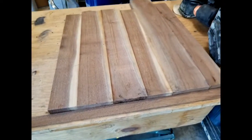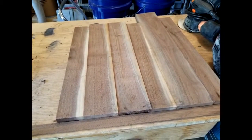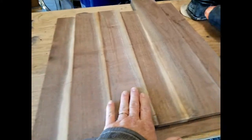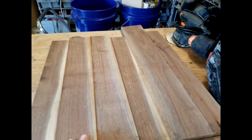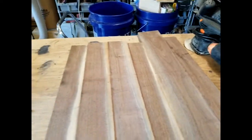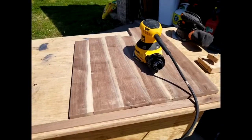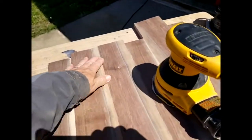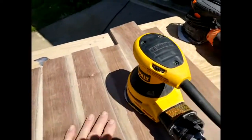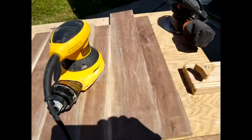Picking back up on the Wahoo board: I just did the V-carve, looked it over, and now I'm going to flatten this board with the belt sander and the orbital sander — hit it on both sides just a little bit. It doesn't need much, just enough to get rid of the pencil marks. I've got the belt sander over it and I can barely tell where the glue joints are just by feeling with my finger. Now I'm going to go over it with some 60-grit orbital action to get it a bit smoother, then move to the finish sanding.